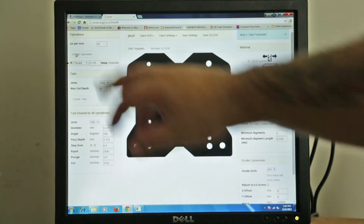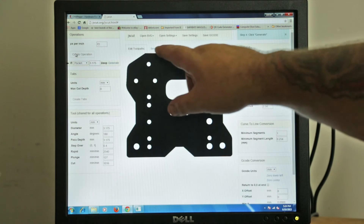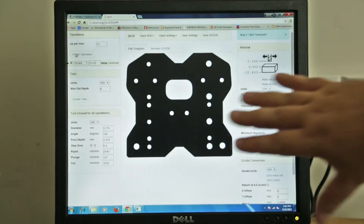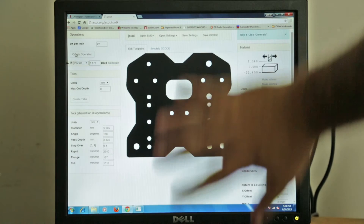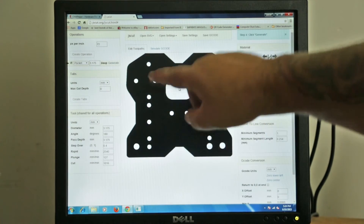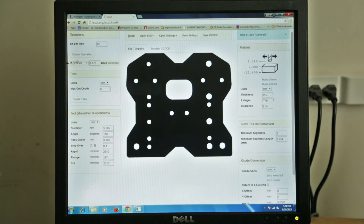Over here it's going to ask what we're going to do. Are we going to cut a pocket? So say, for example, if I was going to cut a pocket, I would want to cut all this out and make it gone — nothing but chips. Or if I wanted to engrave, like a groove in there, and drill holes all the way through it — a recessed area — that would be a pocket operation. You could also make your holes a pocket operation and turn all of that stuff into chips, but it would take longer.